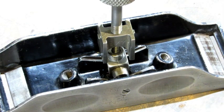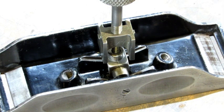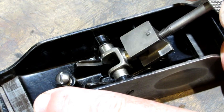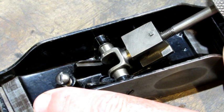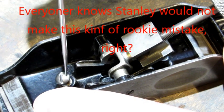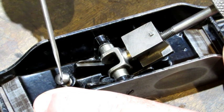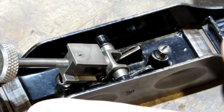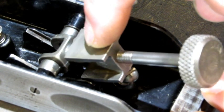The next thing that will mess this frog up is the cap screws. As you can see the holes are still open where the cap screws go — I haven't put them in. I'm going to put them in and show you how that's going to mess up your frog. With the cap screws in and tightened down as far as they go without over-tightening, when you swing it back in place you're going to find out it doesn't work. The frog hits the cap screw before it rests down in the little slot that's supposed to go into that machined area. The frog is resting on the screw and tipping back and forth because it hasn't gone down where it's supposed to go.